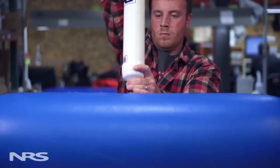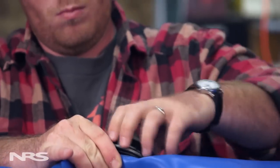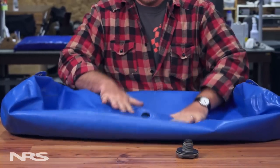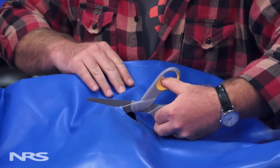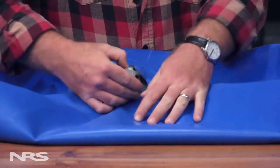We'll start off by removing the valve. Air the boat up to two pounds and use your valve wrench to break the seal. Once the seal is broken, use your hand to completely remove the valve. Once you've got the top half of your valve unscrewed, you've got the scariest part ahead — cutting into your boat to remove the bottom half. Make two small incisions on either side of the valve hole. The idea here is to make the smallest cuts possible in order to get the old valve portion out and insert the new one.